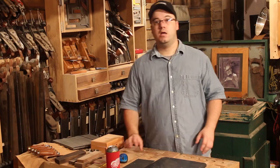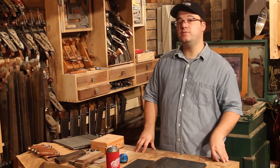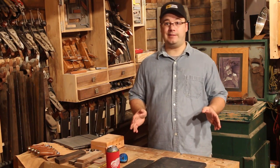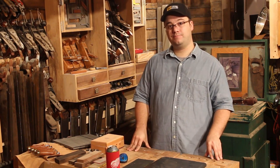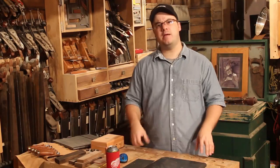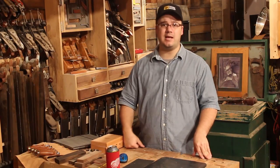I've even seen some smart woodworkers put a coat of paste wax on their plate. If you buff it up really nice, it'll create a long-lasting barrier between the plate and the adhesive. Take that tip to the bank. Spray adhesive is cheaper than self-adhesive sandpaper, but water is free, unless you buy that fancy clean water in the bottles. You can spritz down your plate and the water will suck that sandpaper onto the surface with a little thing called science.